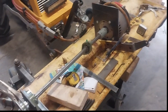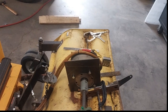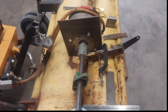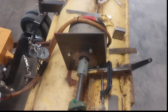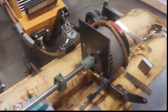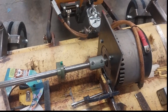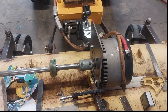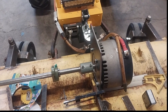I'm just going to go ahead with this. I'm going to put a bit of thought into how to do that so it looks nice, because it kind of needs to be rounded over. I'll weld it down there on the bottom where it's touching, weld it all through the center — just weld the living daylights out of the bottom of it — and then put a gusset or two here and there just to stiffen everything up. Then I will either replace this with my little Love Joy coupling, or I could just keep that in there. Actually, I think I'll have the Love Joy — it'd be better to have a little bit of vibration isolation.